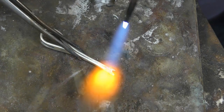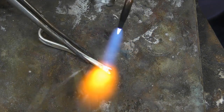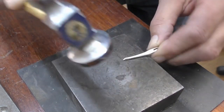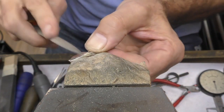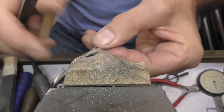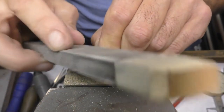I'm losing a little bit of the ends — they're just melting a bit — but that is fine because I'm going to cut it down anyway and level it up. Just tap it one way and the other, trim off the end, and carry on with a finer file to get rid of those heavy file marks, then finish off with 400 then 1200 emery paper.